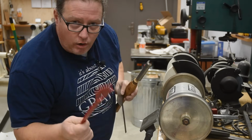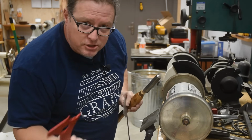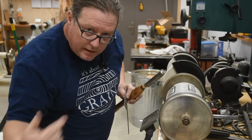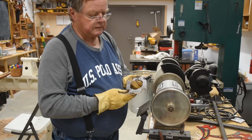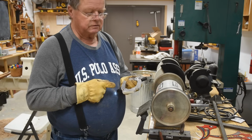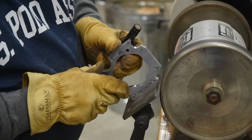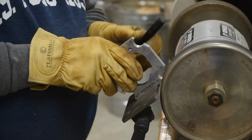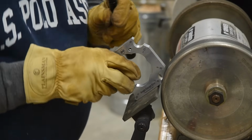These things right here are Dad's, but he also has another one designed by Stuart Batty, a fairly famous wood turner, that he likes to use. I'll let him show you how it works. This is the Stuart Batty gauge, and it allows you to measure anywhere from 20 to 70 degrees. And you basically set it down flat and bring it up to the wheel. And this one is already set for 40. Sean just set it for 40 degrees.